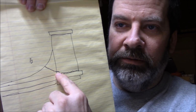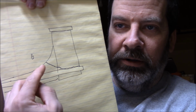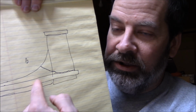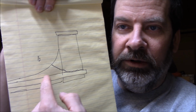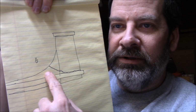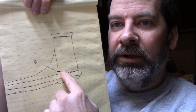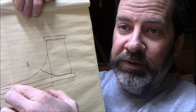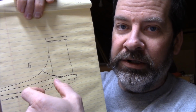It cracked through there because actually the tree is coming down and shearing the limbs here, and it's just an extreme amount of force. And I know on some of the newer models, we could change this to a cast or a forged piece. I don't know which it is, if it's cast steel or forged. They've eliminated some of that problem. But in this case, it's been on there since 2008 or whatever, and this will be the second time I welded it. This time when I got there, it was completely sheared off. This piece was actually independently floating from what I call the boss.